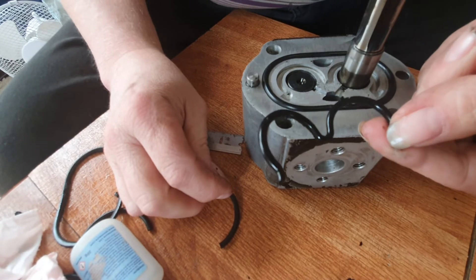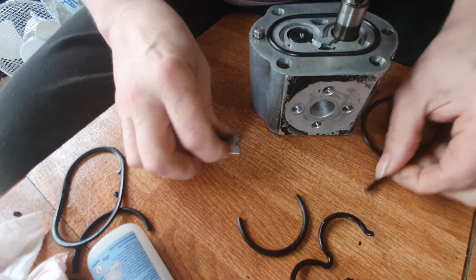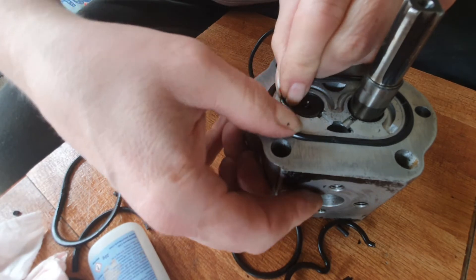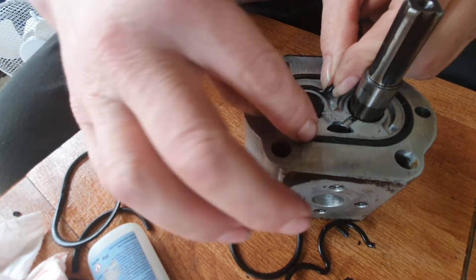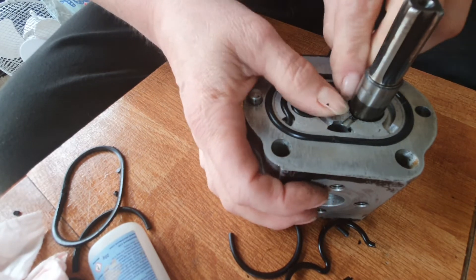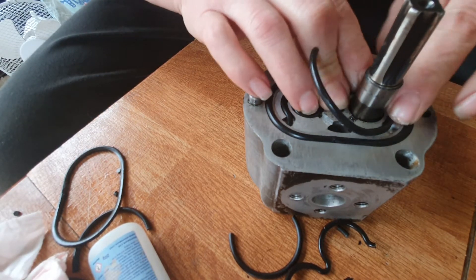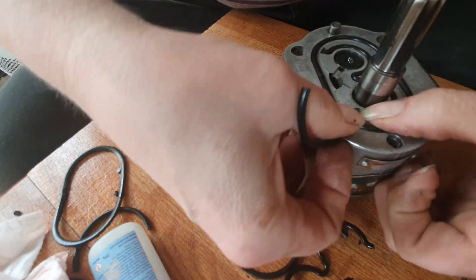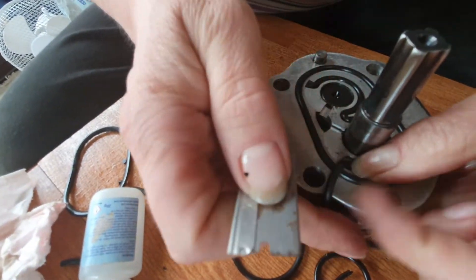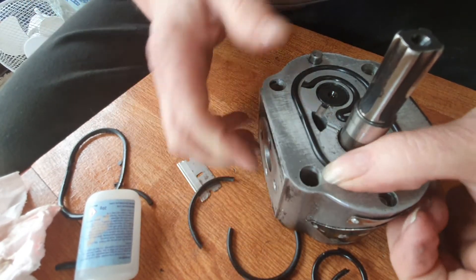Now to make that one, we just take another piece of o-ring. You can buy seal kits, but you would have to wait probably a couple of weeks if you're lucky. But at least doing it this way you can do it straight away, so you don't need the special shaped seals — they do actually work perfectly well. Just feed it in like that, cut it to the right length, which is about there, push it in, and there you are.